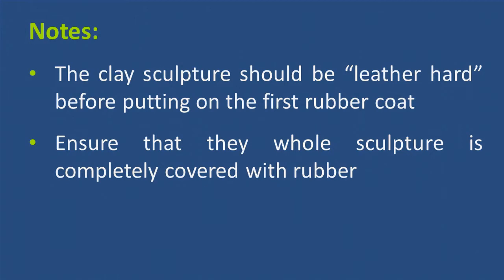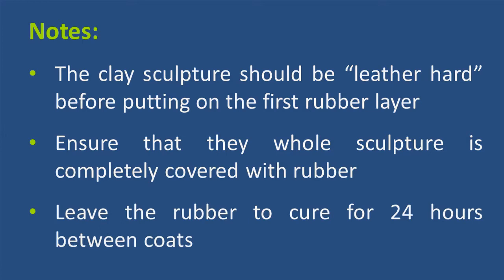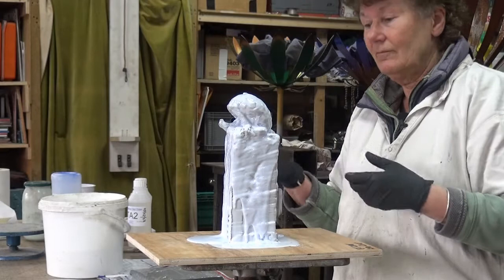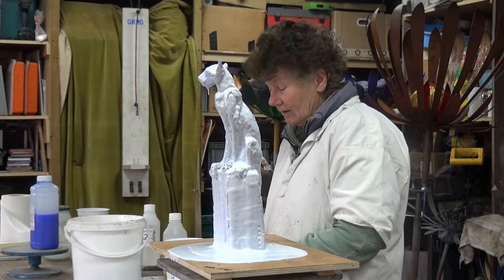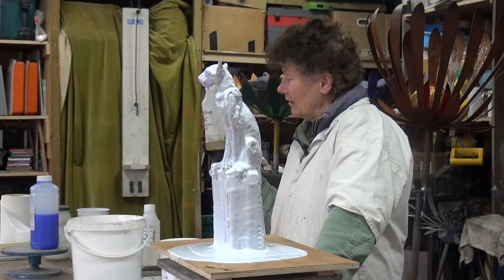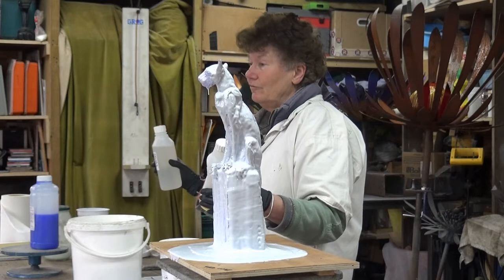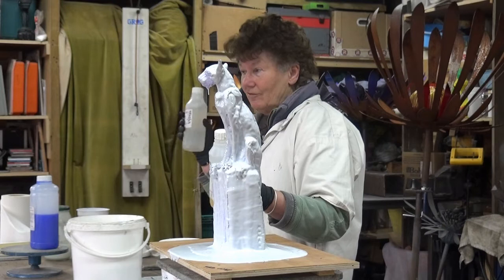At this stage you can leave it for 24 hours, put the second coat on, then you have an atmospheric seal. You know it isn't going to react, it isn't going to dry out — it is in stasis until you want to come back to it. I'm now going to add a thickening agent — that's a thixotropic additive. New is strong; old is deteriorating and is not as strong. It's okay to use for your second coat because it doesn't go as thick.